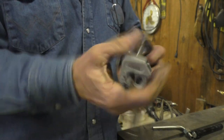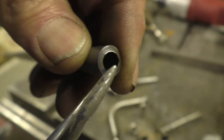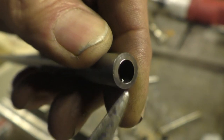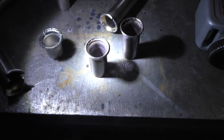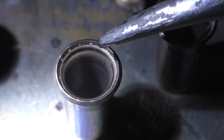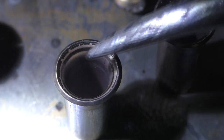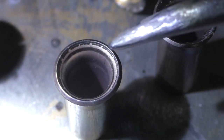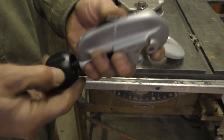Have some patience with it — it'll get there. Once you get it cut, notice it's going to have a little lip of steel inside and you really do need to get that out, especially on stainless. On this one that's already been flared, you can see right along that rim there's a little broken line — that is the burr that's been folded back and pressed into the flare. That's not going to be a good seat, so you want to deburr your tube first.